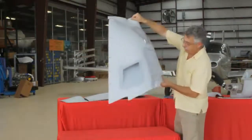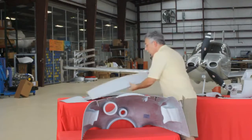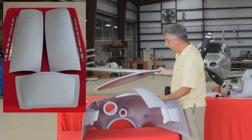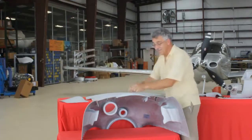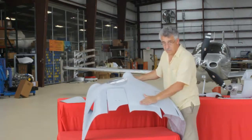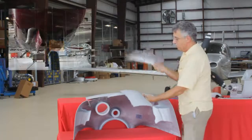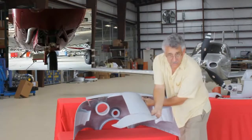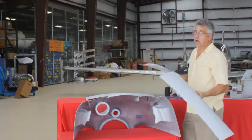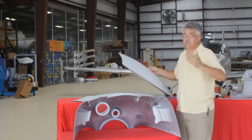Something really cool here — you'll notice the trailing edge of this cowling is curved, and that's for a purpose. We have new nose gear doors that are also part of the kit. They overlap and close like that and they land on the hump. This blend blends way up back into the cowling — this is the normal shape and then we start bumping up onto the nose gear door shape. The nose gear door shape comes aft, and we added a little more back onto the belly of the airplane. Aerodynamically, these doors are much longer than the stock doors — they are overlapping, smooth, no lumps and bumps, and longer length means a smoother transition.